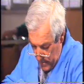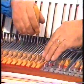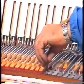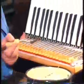The valves, which open when the key is pressed and thereby push the air from the holes to create the melodic sound of Fantini accordions, are then fitted. A special wax is then melted between the pin and the valve to form a single body between the two parts.